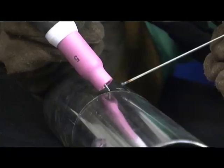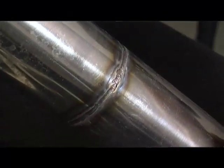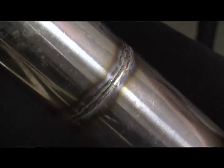The stainless tubing actually went pretty well. Some spots could be welded without any filler, and in other spots adding filler made a nice bead too. With each material you have to figure out what amperage starts the puddle and what amperage burns through it, then keep it in between so you create a perfect bead without getting it too hot to where the metal just falls all the way through.